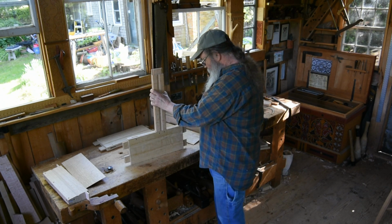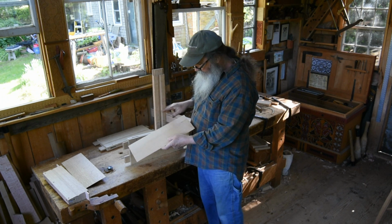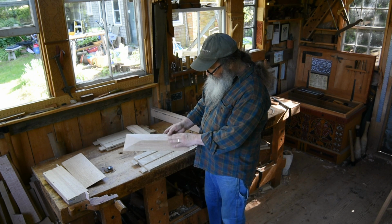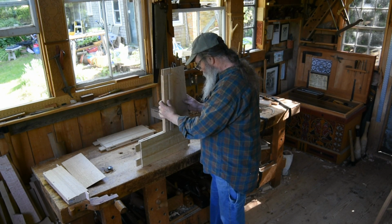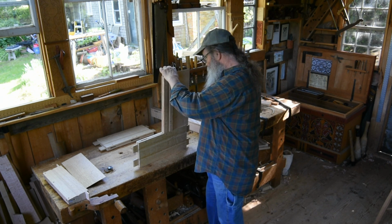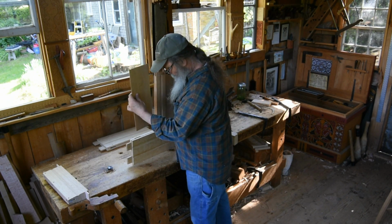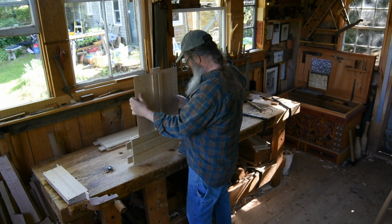And now you can put the beveled panels. Here you see the flat side, whoops, put that down, flat side here, and maybe can pick up the beveled faces there. So that goes to the inside, and tuck those right in the grooves in the muntin and the bottom rail. And these are very fragile. The edges of those are thinned down to absolute nothing, and they're very delicate. If you smack them around too much, you pay for it.